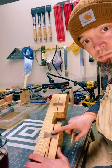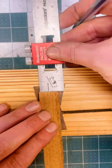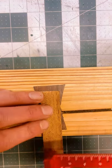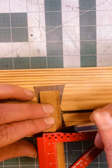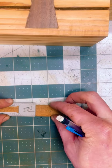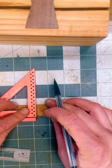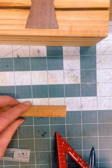In order to do this, you already have to have your original bowtie in place. For my new bowtie I am choosing a lighter color wood, just to kind of set it off a bit. We're measuring out the size of the new bowtie that we're going to be putting in. I chose to drop it down about a quarter of an inch, that way we still had a quarter inch of the walnut showing.